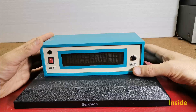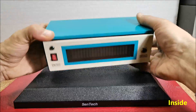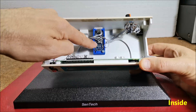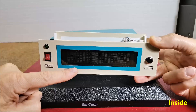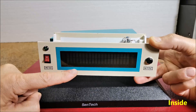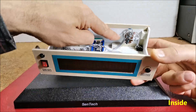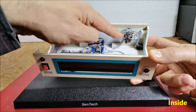The presented device is very simple to build and consists of several components: an Arduino Nano microcontroller, a VFM202MDA1 type VFD display slightly modified, a stereo potentiometer, and several resistors and capacitors.